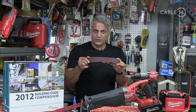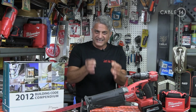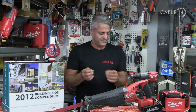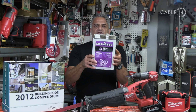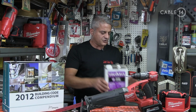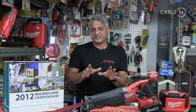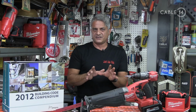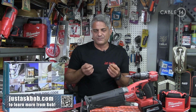You must remove the old caulking or sealant that's there. Once you remove it and you clean it with the abrasive action of the sandpaper, you need to use acetone. You need to make sure to clean the area. So it's all about being clean. It's all about being neat. Pull off the old sealant on the corners on the eavestroughs, sand it, rinse it off in the acetone, and then apply the copper elastic.